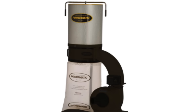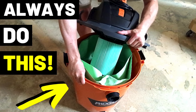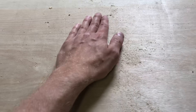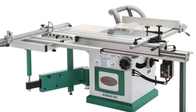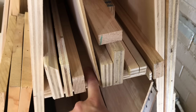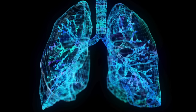Some large dust collectors have expensive pleated filters that catch smaller particles. For my shop vacs, I use a filter bag and pleated filter combo, which gets me closer to HEPA-level filtration. I did a video on these filters and what HEPA means, so check that one out if you're curious. But even with all these measures in place, you'll still struggle to catch dust in a shop. Cutting lumber is just a violent process — dust explodes into the air at the point where blade meets wood, and from there it can go anywhere. To catch all these particles, you have to bring your suction really close to the blade, but you only see this effectively engineered on very expensive industrial cabinet saws, which few people can afford. So the rest of us have this super fine dust floating around the shop constantly. No matter how much vacuuming you do, you'll never get it all, especially since your vacuum outflow just stirs it up more. This super fine dust is what causes us to get sick — it gets way down in your lungs, causing problems both immediate and chronic. You have to try to control it at full shop level.